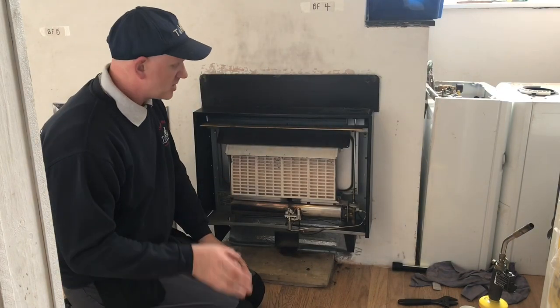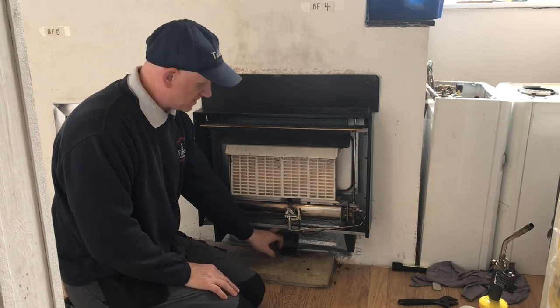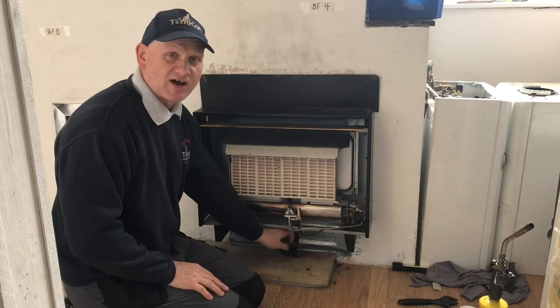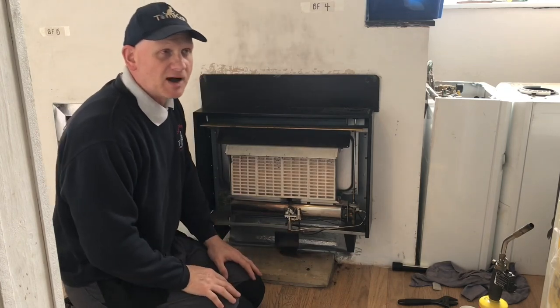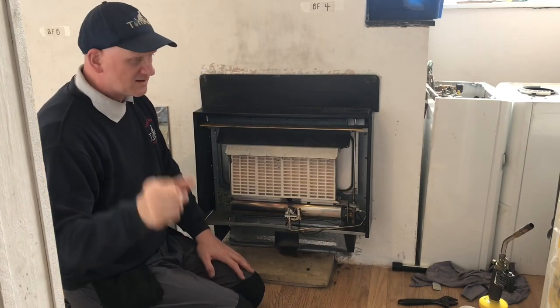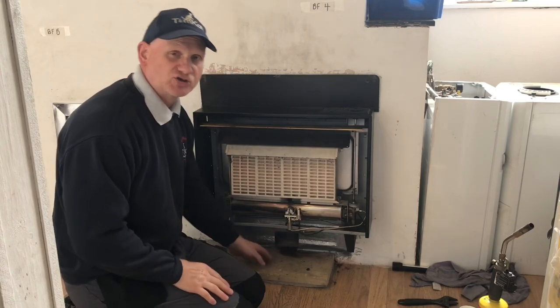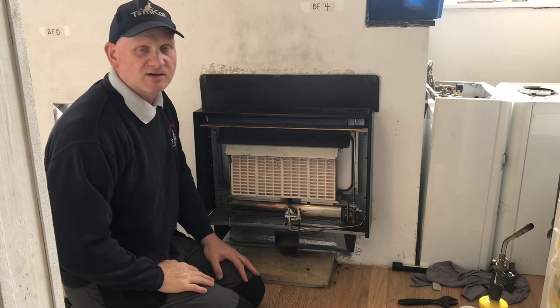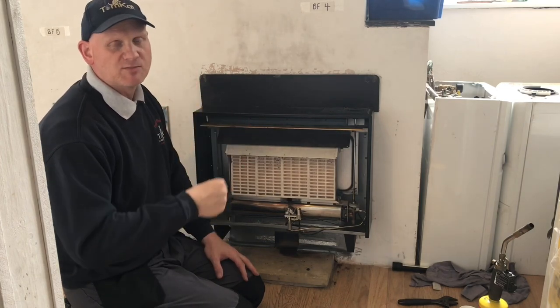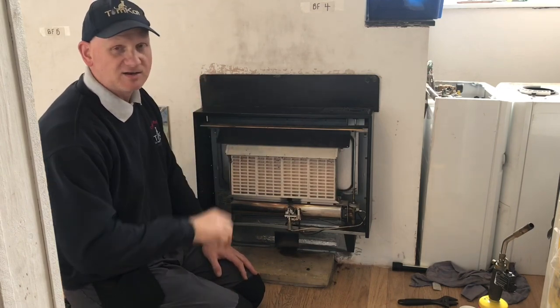Okay, so what you've just seen me do is, first of all, I reconnected the gas underneath, I opened the isolation valve here, I then went and did my tightness test. Remember the conversation we had before about tightness tests? After a successful tightness test, you must always purge. So you saw me purge. I took a picture of the meter with the first index reading, then I purged the minimum volume and then took the picture of the second index reading.